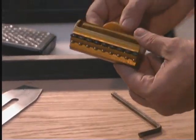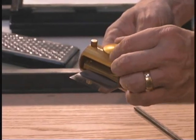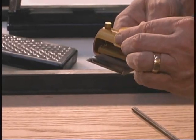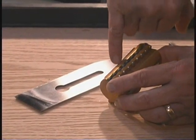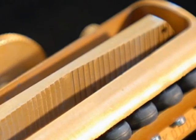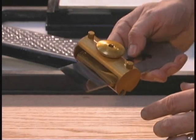Setting up the SharpSkate is a very easy thing to do. Simply take the plane blade, insert it into the SharpSkate, and begin to tighten the head screw until it's just snug so that the blade slides. You'll find that inside the SharpSkate, just under the hold-down, are a series of flats with walls. Each one of those walls is a guide used to align the side of the blade so that when the blade is inserted, it locks up against one of those guides and doesn't move. Tighten it down and let it slide against the guide.